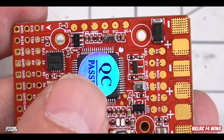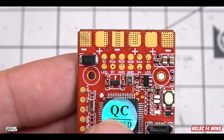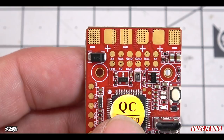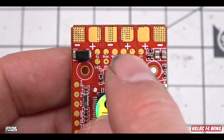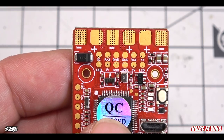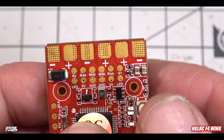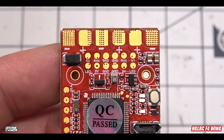On the top rail we have power input on the top left — that's where your battery and capacitor connect, bringing your ground and positive there. If you're doing over 6S that's where the capacitor comes in. The next two pads over are motor one and motor two, where your ESC wires connect. You solder your motor wires to one side of the ESC and the ESC wires go to these tabs.